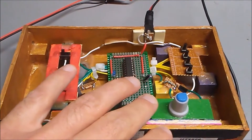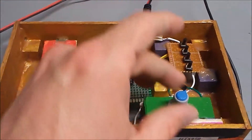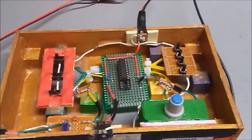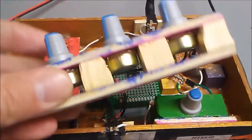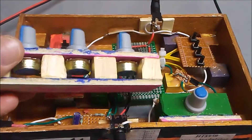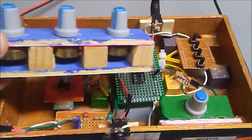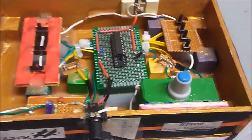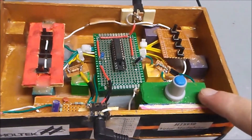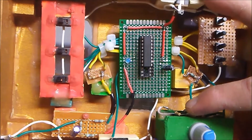The schematic diagram did not include a potentiometer on the oscillator inside the chip, so I added that. In the previous video I created this big thing with three 10k potentiometers, but I decided it would be better for the sake of space to just use a 50k. It also has a fixed 10k resistor in here as well.